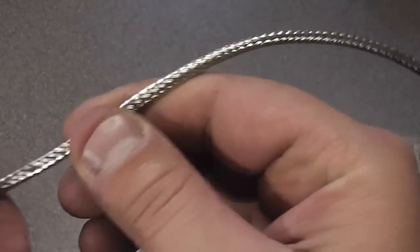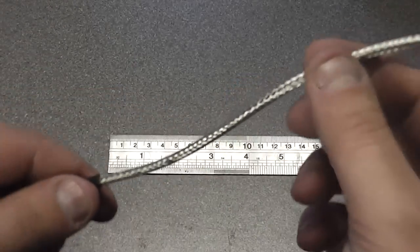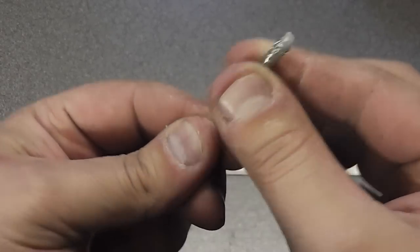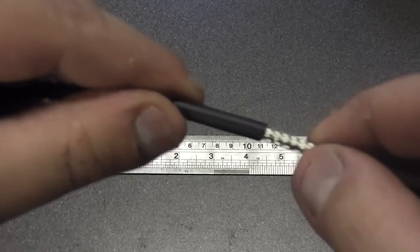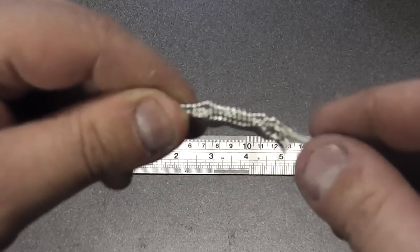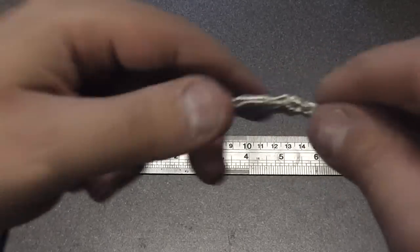Then you've got the inner conductor underneath the outer braid. What you need to do is fold this braid back on itself. To do that, as you may have seen in other bazooka build videos, you need to relax the braid so it's pretty loose. If you don't, you'll never move it at all. So balloon it out and relax it all the way down — you can see that it does actually move now. Just loosen it off carefully without damaging it.